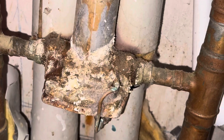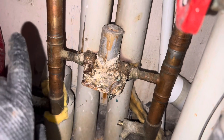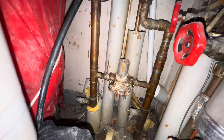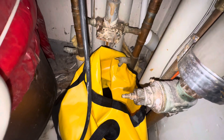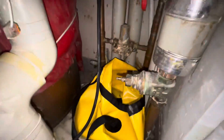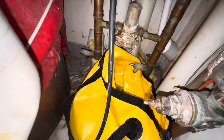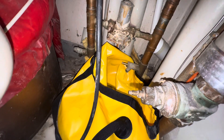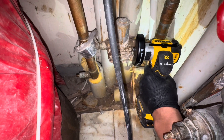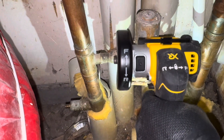So I've come to this leaking bypass to swap it out for a gate valve, but I'm going to cut back everything and basically remake that section, because they are soldered on iron fittings, which is not what I wanted to be doing. Back to using the flexi bucket to drain out into the washing machine waste. Just got to remember to change that drain cup washer.